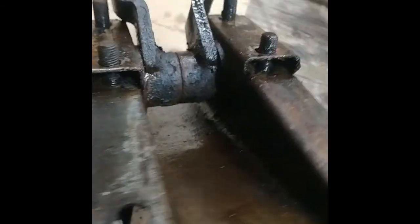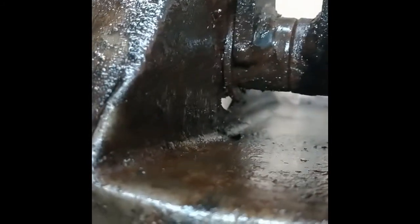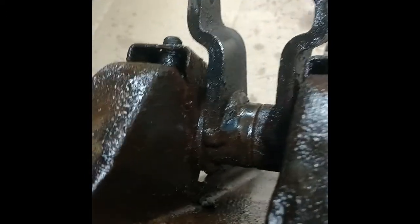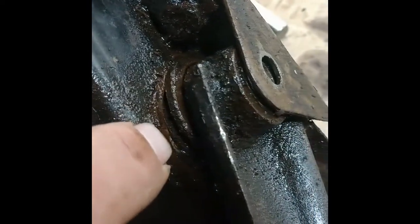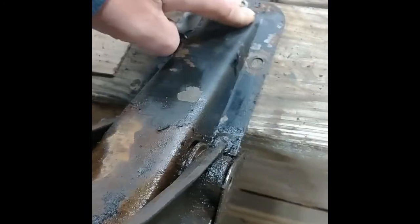I'm thinking the stuff I read online might have been for a different pedal box. It's definitely coming up now and you can see the pedals come up — there's a gap down here. You can see where it's separating right in this region. The best way I found was to hold it on the edge of the table and tap down on the bracket, or even the pedal if you're careful. That's how I finally got it started.